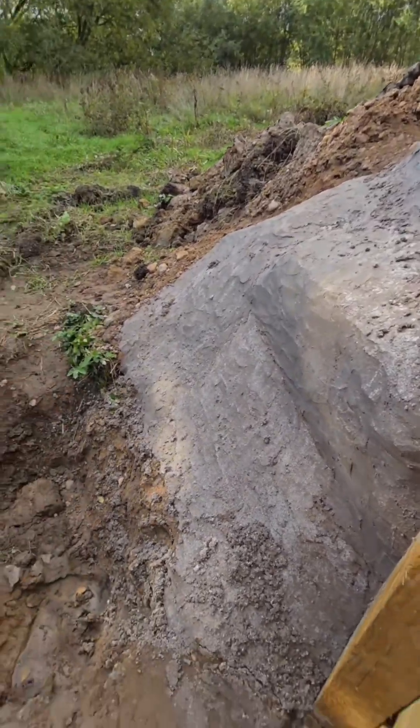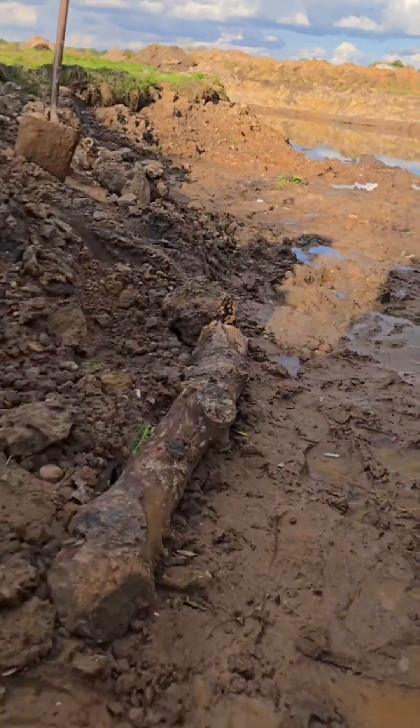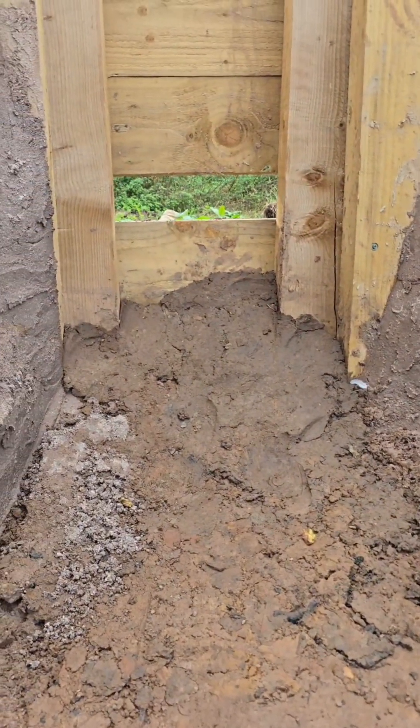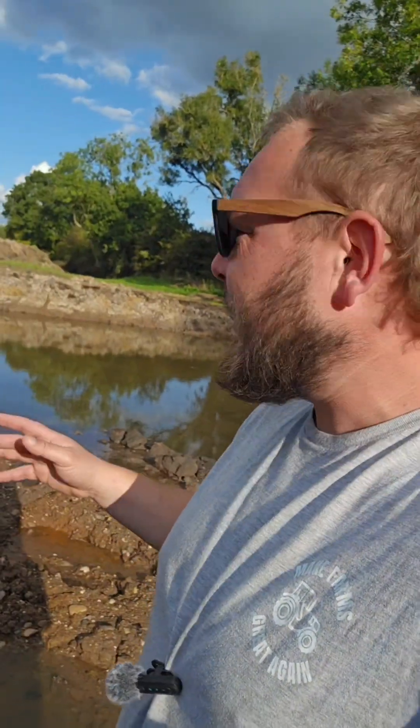The dam's finished and it's a really good job because the pond is filling up fast. Got all of the rendering down on the tops of the walls and all the ones on the outside too, so in theory that is complete now. The way it's all holding water so far, I really do think there's going to be no problem at all with it filling up to the level I've set with the hole. That hole is where the pond should be, so it should be about two feet deep minimum. I've put the rest of the sleepers above it so if we have one of the mega floods - due to huge industrial estates and lots of houses built upriver - I can control any massive amounts of water coming back into the pond by blocking up that hole. If I know it's going to flood I'll come down and whack a piece of wood across it, because if I put fish in here I don't want them swimming back out either.